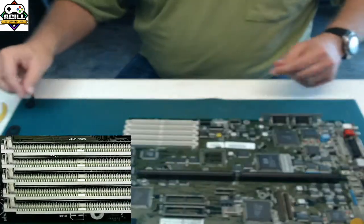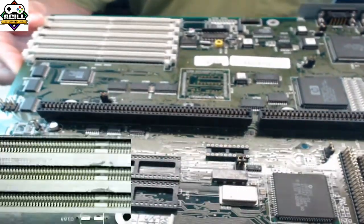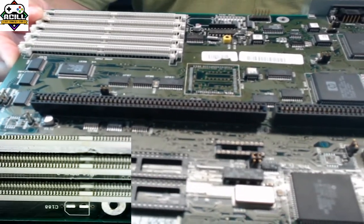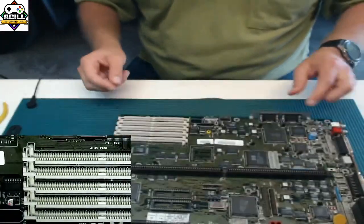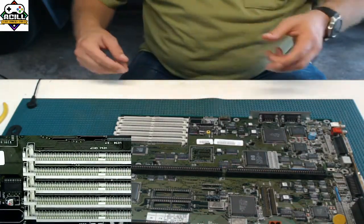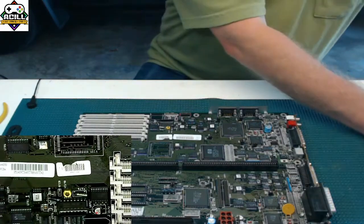And if you take a look at it now, you can see both pads, and I'll go ahead and zoom it back up into the microscope here again, and you can see that it is much, much cleaner. That is how you want to do it. So pretty important, actually. I have seen boards come back to me where people just got it off as best they could and put another cap right over the top of that. It's only going to kill your board. It's not what you want to do. So there is a lesson in capacitors. Easy stuff.